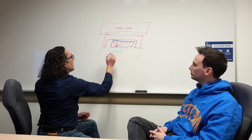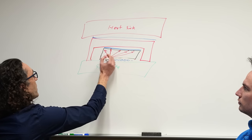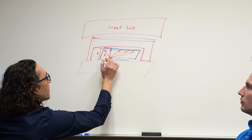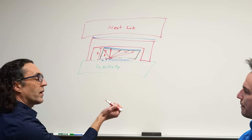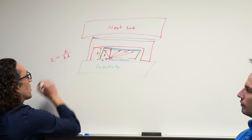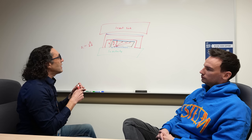So the heat goes in three dimensions — this is conduction. When I was mentioning the temperature gradient that drives the heat transfer, there are a few parameters that come into play. One is the length — how far does this go. Then the area, meaning how much area is the heat transferring through. And then finally, the thermal conductivity of the material. So I'm going to write it in terms of the thermal resistance as a function of L over K times A. K is our thermal conductivity — that's how readily a material can transfer heat.